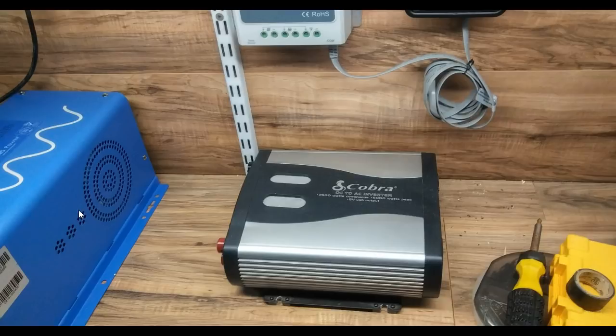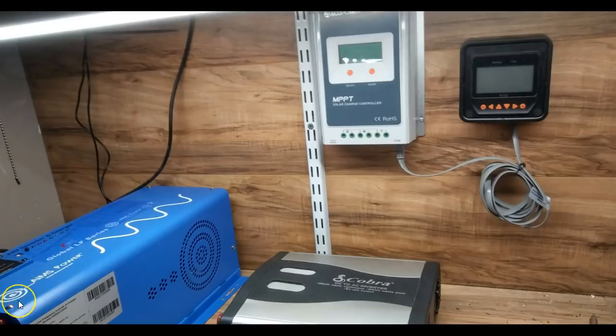The AIMS also has a built-in battery charger, so when you plug it into the wall — if you don't have enough sun that day or during the night — it has a built-in 24-volt charger to keep the battery bank charged. Not only that, it has a sensor system: if your power goes off from the electrical grid, this will kick on like a generator and start pulling from your batteries into whatever outlets you've assigned to your solar system.